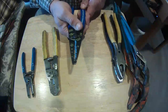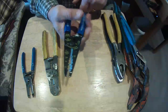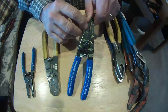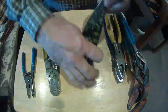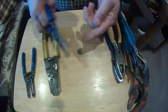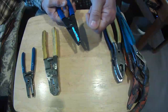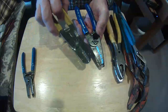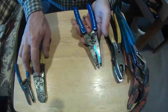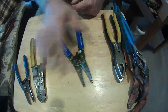Now this is the new one on the market — it's been out about four or five years. Spring loaded just like the others, plastic handles with big grips for comfort. But this is made for Romex: 14-2 and 12-2 Romex. It's also got a 14 and 12 gauge stripper, plus 6-32 and 8-32 screw cutters. So I can take my Romex, strip it out, and once I have my individual conductors, strip out the individual conductor, put it in the hole, give it a twist, make my hook, and put it on the device. As the strippers have improved, where I used to just handle wire, now I've got wire, jacket, and screws. These are what a lot of electricians are now carrying, and they also have little bitty pliers on the end so if I need to grab something, I don't have to grab another tool.